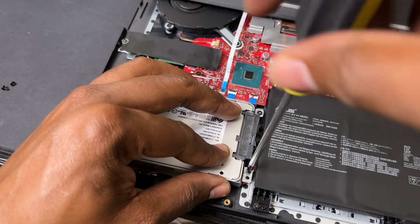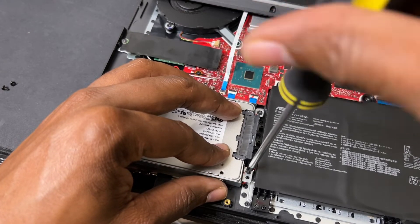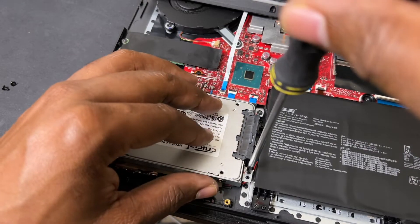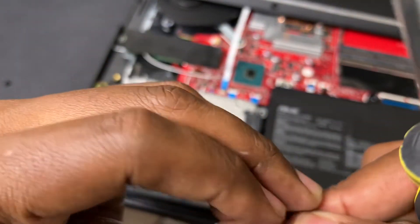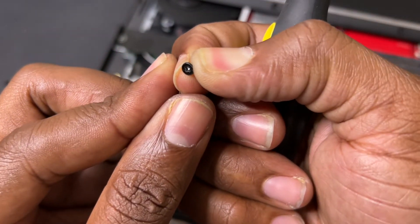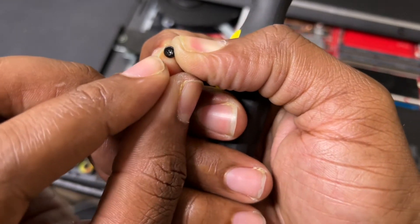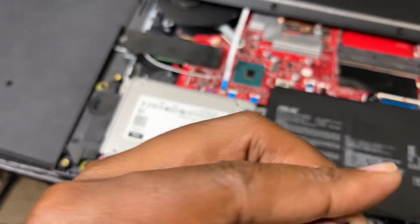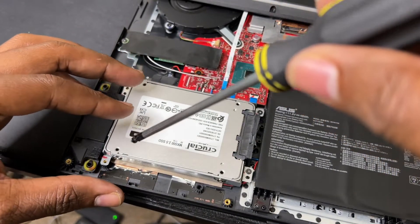That's the benefit of having magnetic screwdrivers. You don't want to tighten it too much — just finger-tight. Once you feel tension, stop, because you don't want to destroy the threading of the screws. Once you over-tighten and destroy the threading it's basically no good — you'd have to pry it out and get a new screw, and these screws are not easy to find, so take very good care of them.